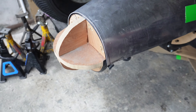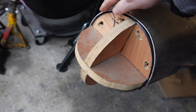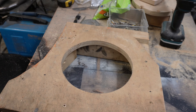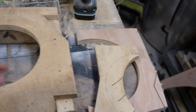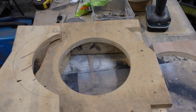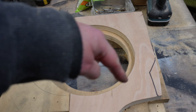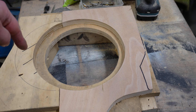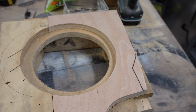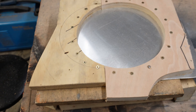Today's job is to try and make a domed part which will fit on here and be welded along the edges. The cunning plan: put the aluminium over a space I've made for it to bow down as I hammer it, then put the frame pieces on like that, put screws in a ring all the way around straight through the wood and through the aluminium down into the wood underneath, then start just hammering in circles. Ready for being hit now.